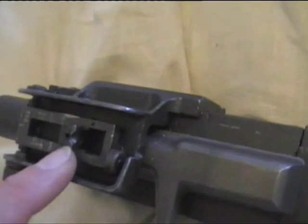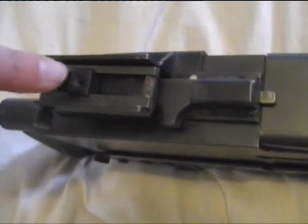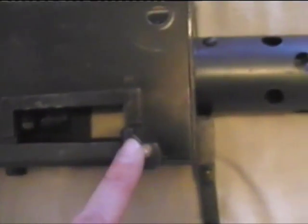This sight here can also be used in its flat operating position. I haven't done that on mine — I've just made mine so that it has to actually be up. But it's easy to make a sight with a piece sticking up here and a little notch. This is actually adjustable on a real one, but I didn't go to that trouble. It's just a replica, an ornament for mounting on a jeep. Most people will not know the difference.